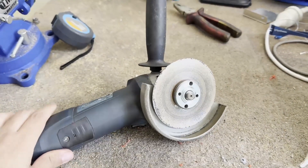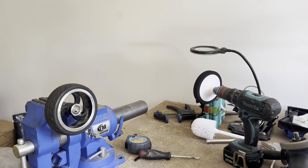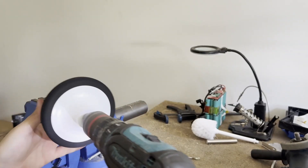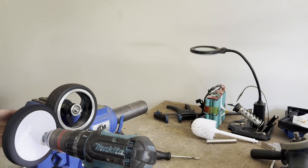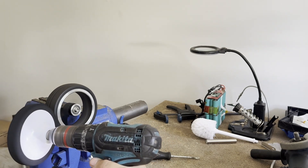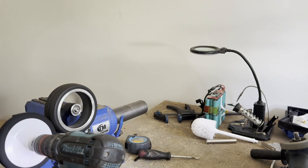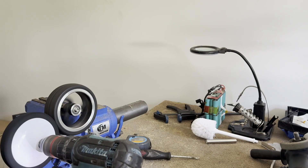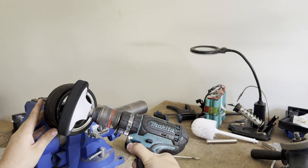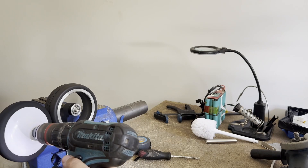First I need to get the old head off. I've put the new head on — let's start spinning up. I ditched the cheap plastic wheel and found a scooter wheel from one of my old e-scooters. It's a solid aluminium hub with a solid rubber tyre. I'm trying it first with this foam wheel I also got from the hardware store. I can attach it to the outside to get speed, and then try attaching it to the inside to really boost that speed. But these are growing pains — it wasn't working very well. And the next error I made was trying to attach a drill head that's only rated at 3,000 RPM to an angle grinder that goes at 9,500 RPM.